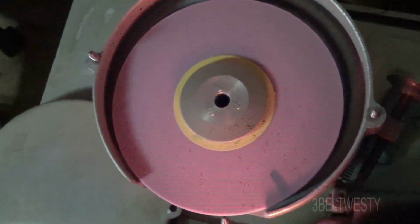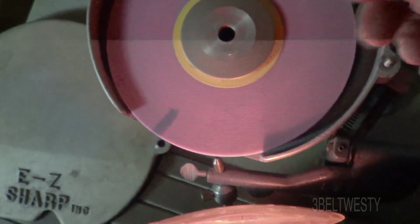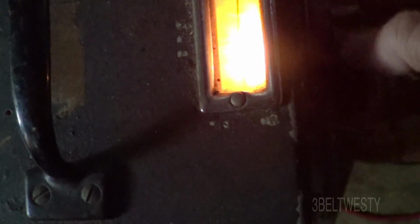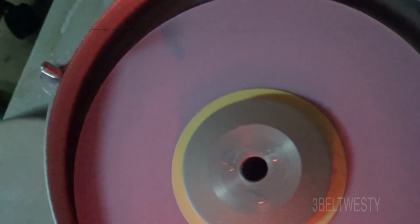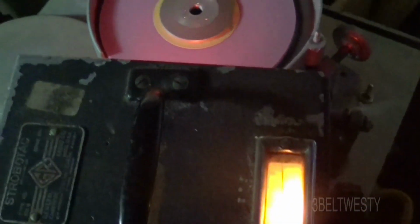So when you use a strobe, this is actually a neon strobe, neon light. What you do is you got to make sure you go up to find the fundamental. So you go up twice on that. 3600. There it is. It'll tend to pop out a lot more. And I got the lights off here purposely because it's hard to see with a neon strobe.